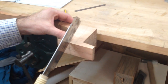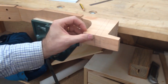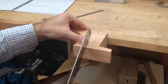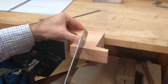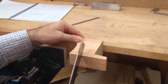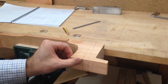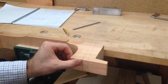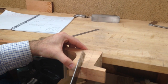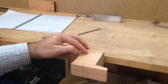What I'm going to do is advance along this face but also down this face. So I'm moving there and also down here. You can see that I'm cutting along here but also quite a lot down here, following the angle line that I want to be cutting. In doing that, I'm establishing the angle that we need to have all the way across.